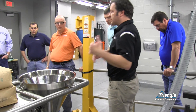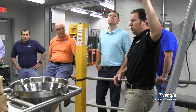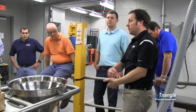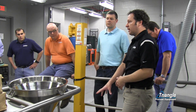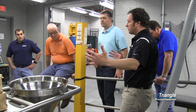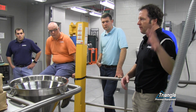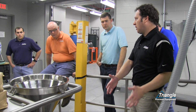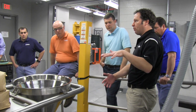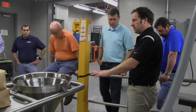The next level, besides a feed pump, is if somebody wants to feed this off their loop running at 60 or 90 PSI — we've got to be able to get rid of all that pressure, and that's really not going to work coming into the table. So in an installed system, the ideal solution would be, if you have to take the pressurized high flow, to have that feed a balanced tank, and we draw from the balanced tank so that we have that break to atmosphere right here. It makes everything much more simple on this end.